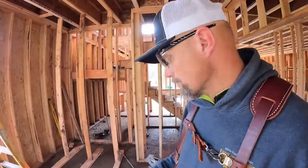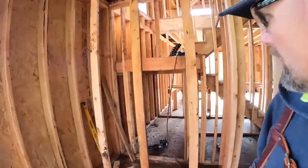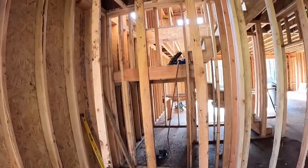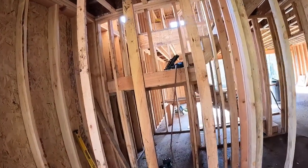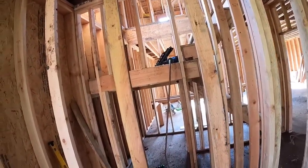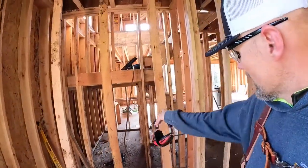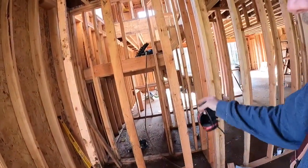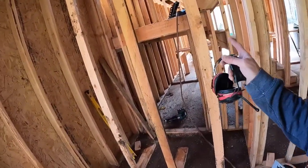So I just created an opening, the width and the height, for a 2'8" by 5'0" door into an existing framing. Header nailed off real well on both sides, and I'm going to have plenty of clearance so I can get those Christmas lights and that sort of thing in and around the corner there. Lots of storage. We'll end up filling that completely up, but anyhow, that's the framing.